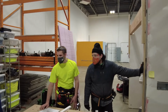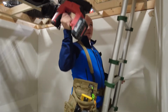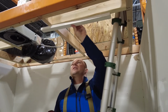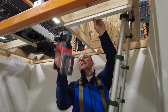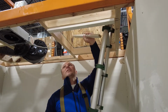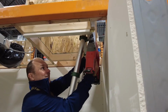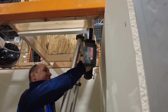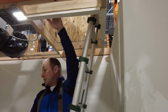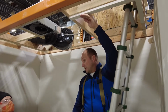All right. So someone had a question earlier about the existing trim, right? In the real world, there'll be drywall here, right? As far as what we're concerned, it doesn't matter. Say I have a piece of trim, and that piece of trim has drywall in between, okay? We did have some trim laying around here somewhere. So that trim is just barely, that's about typical, right? For the ones you guys have seen, 1/4 inch, 3/8 of an inch tops, maybe nothing over here. Pretend this is your trim, okay?